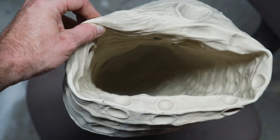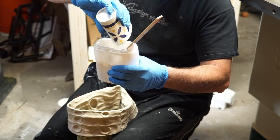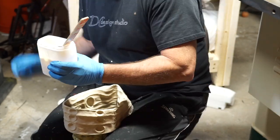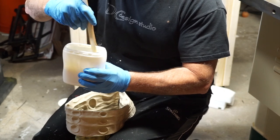Take your arm puppet and fold over the end just like a pirate boot. We are going to fill up half the arm puppet with flex foam at 10, so mix part A and B. I found just one of these cups of each works perfectly. You want to thoroughly mix part A and B, but be quick about it because this stuff will start to foam fast.